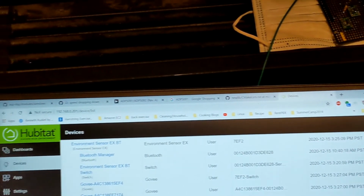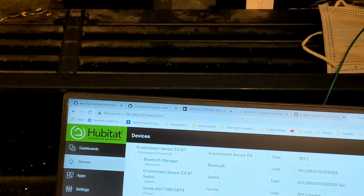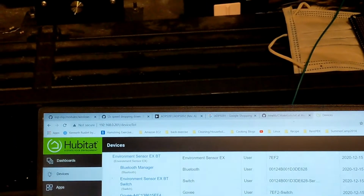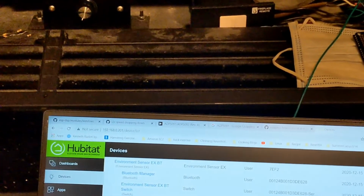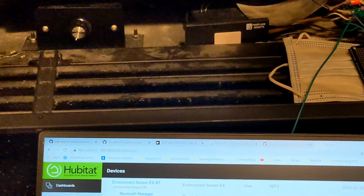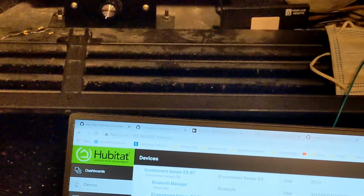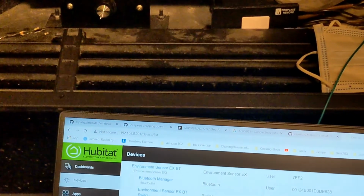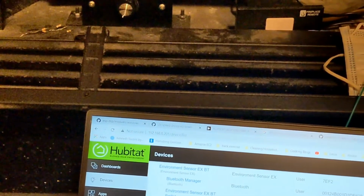And the other thing is the power generation part of it, which is I'm primarily looking at using waste heat to generate the energy. But as everybody knows, another common source is solar energy. What I'm interested in is, if you look at what the input is so far in this demo, it's a very low voltage. So I'm thinking of getting something like a low-power indoor solar panel rather than outdoor, so your room light is enough. In the old days, there were calculators that used solar power. That kind of solar power, maybe not that small a size, but the concept is not an outdoor solar panel, where you have a lot of energy.